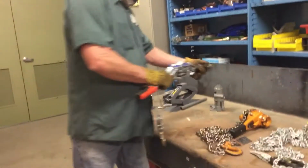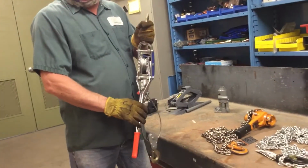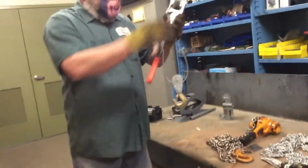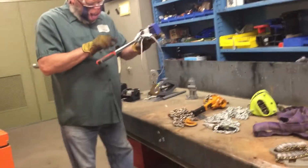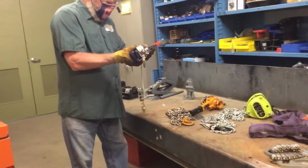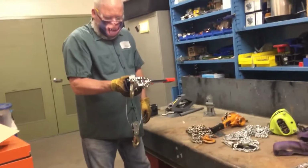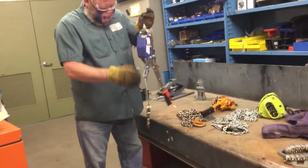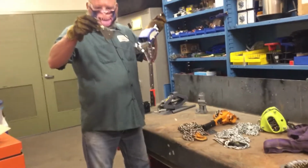Third one is the cable come-along, used to only move things horizontally. So we'd hook it up and pull something together horizontally. In the book it says these are not rated for vertical lifting. The manufacturer says they are, but we will go with the book and not do it, even though it has a rating on here for vertical. It also has a rating for horizontal. We make sure the rating is above what we're trying to move. Check the hooks the same way. These are not marked like those are, but I'm sure they're rated for the same thing.